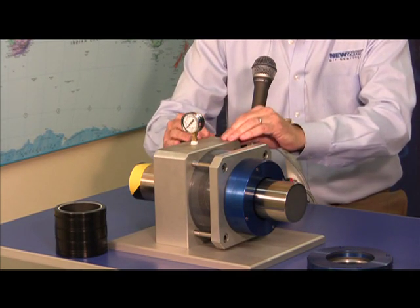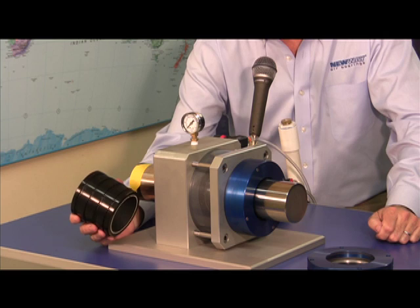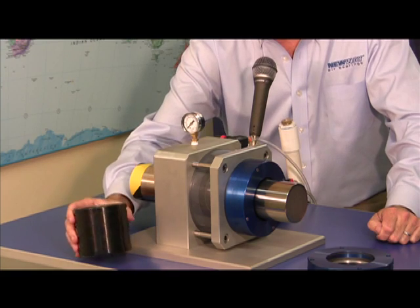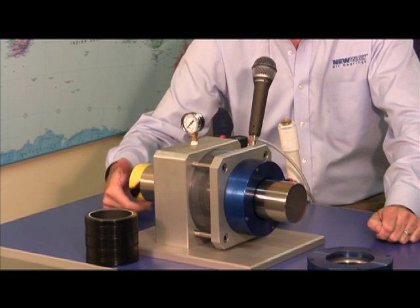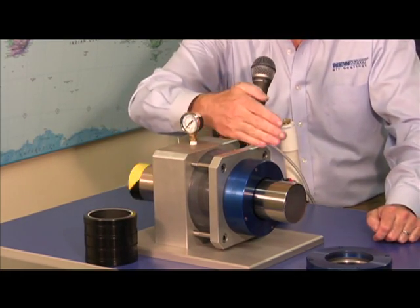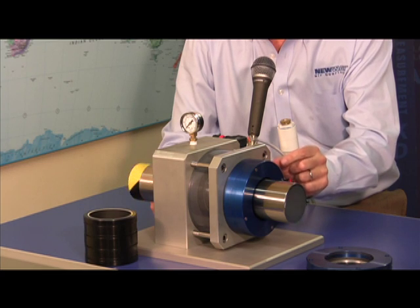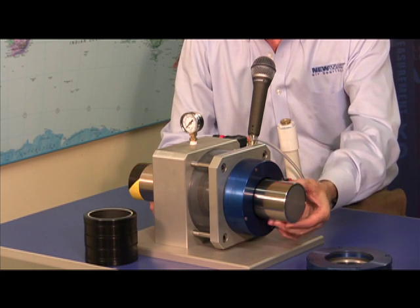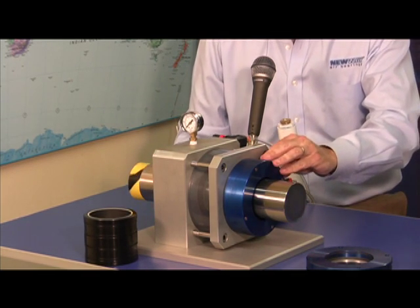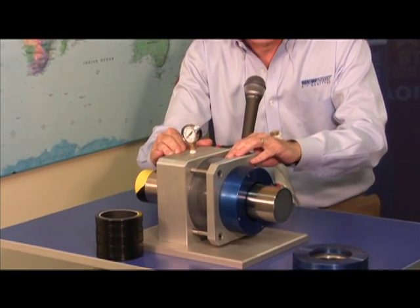Back here we have another block. This block is containing a 3-inch diameter air bushing. This is a black housing because our imperial sizes are black and our metric sizes are blue. This air bearing is supporting the shaft radially in a frictionless manner, but it doesn't give it any axial support. The shaft is cantilevered through the air bearing seal where we have face seal air bearings acting against a runner that is spinning with the shaft via an O-ring. Between the air bearing seal and the air bushing, we've created a plenum that we can pressurize and or fill with contaminants.